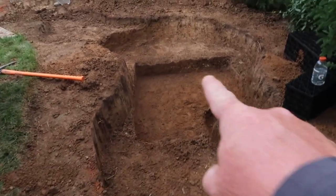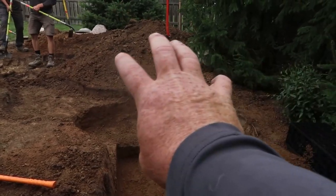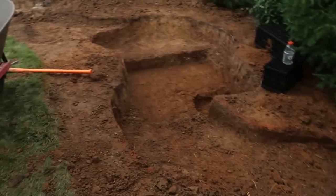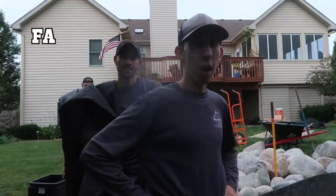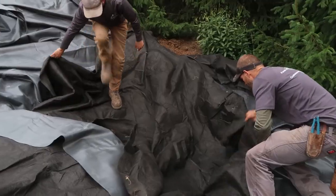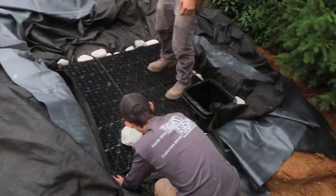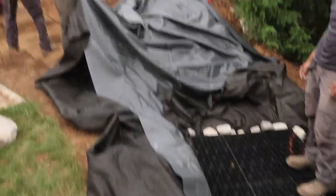You can see now the clear footprint of where the aqua blocks and the pondless vault go, and where we dug out for the waterfall to come in. There's a high side over there so the water will drop down, shoot across, and carve out that area. We need to make sure when we put the rocks in, we accentuate the curves we've carved out. Because this yard slopes so much, it's really easy to do our dry stream overflow — this thing just looks like it keeps going and going. Reservoirs in — fabric, liner, fabric — six small aqua blocks, and the pump vault to house our SLD 2-5 pump.